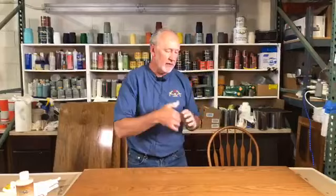Remember that doing a tabletop is not an easy job — tabletops are probably the hardest thing for a do-it-yourselfer to finish, especially with hand-applied finishes. All the pros spray; every table you buy in a furniture store has been sprayed. You can't expect professional results with a hand-applied finish, but they'll turn out very nice. The grit I just used was a worn-out 220, so it's probably 600 or higher by now. When rubbing out this way, I would do a 600, 800, or even 1000 grit pad, or use worn-out 220 pads — they work fine too.